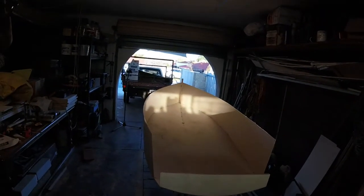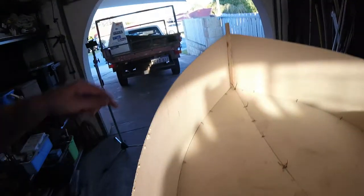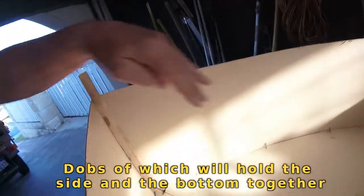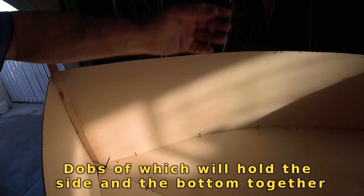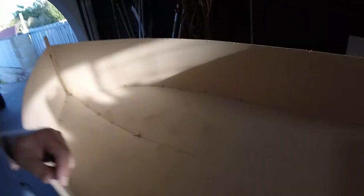I've been going for about five or six hours and this is what I've got — it's only just stitched together at the moment, I'm going to pull it apart and fiddle a little bit more. But you can see basically how stitch-and-glue is done. In the old days they used copper wire twisted together; I'm using cable ties because that's easier. I will put thickened epoxy around the edges. There's going to be a bulkhead here with the mast step, and a seat about here — there's a bit of fudging to work that out.